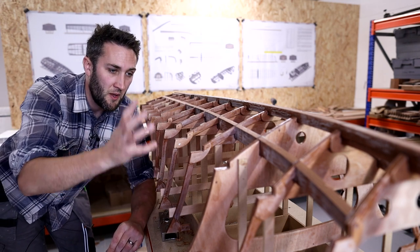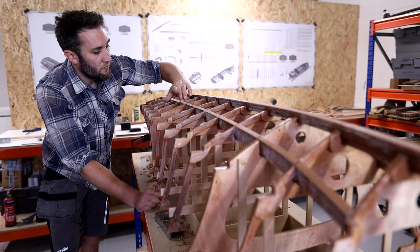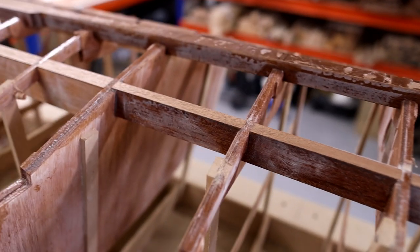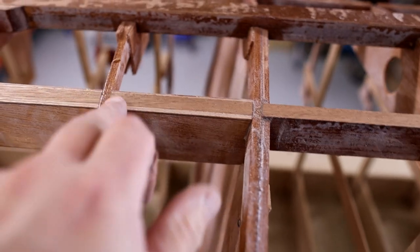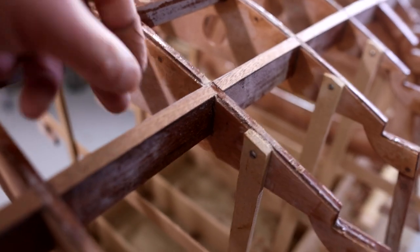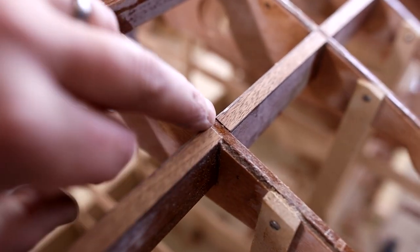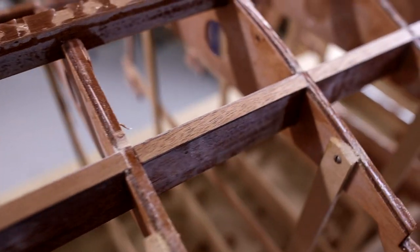We're a good distance along - we've got a little bit high still as you can see on some of these notches. You can see our reference line there, and the notches are a little bit high - the stringer is still slightly high. You can see that marking line there, and on some of these internal edges you can just see a little bit of epoxy still on the bottom face, which indicates that this face here is correct. I actually knocked a little bit out of that frame there where I was sanding the epoxy off, but we'll take the frame down slightly as well so that'll be okay.